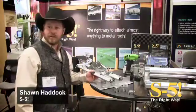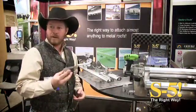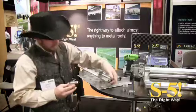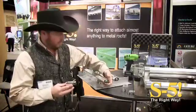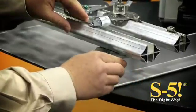The first one is a utility strut. This is used in conjunction with a new clamp that we've come out with. It's a flange clamp so that you can easily put a bolt from below the clamp into the throat of this channel. This channel has a square nut so you can easily adjust the clamp along the base of it.